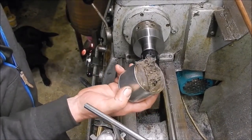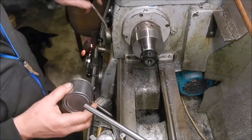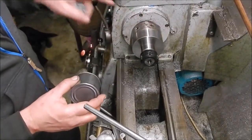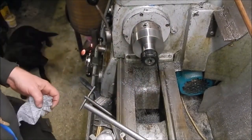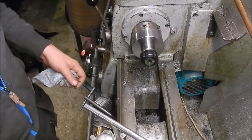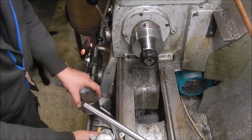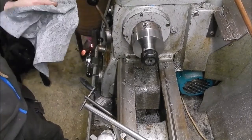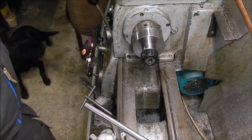There's a guy on YouTube called Paul Sellers, he's a woodworking guy, very good woodworking guy actually. I was watching one of his videos, and he has a little tin just like this. I mean, this is just a piece of cloth, obviously about that wide, big long strip. Wrap it up in a roll, like a toilet roll. Fill this tub half full of oil. Stick the cloth in, and it makes a brilliant, you know, with my other lathe, other chucks and stuff. When I finish, I just put it in a low speed, spin it, touch it with this, and it puts a film of oil everywhere. You can go over your cross slides, top slide, anything you like. It handles the lot, and it does for what it is. Brilliant. Great little idea.